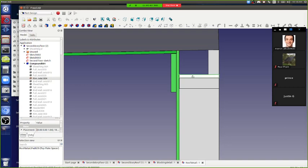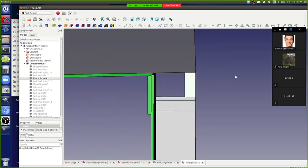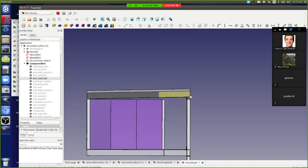So you're gonna have 4 strips of that because it comes in 8 foot. For this one, you might have some 16s. We do have at least one, but yeah, you can draw those out in 16s. So just call them two of them. These are basically going to be formed into the rectangle around, like just the plywood. One side, just one side, because it's slanted. The riser, right. It's just the riser. Okay. The 1/2-inch exists only on the back wall, which is the west wall. So here, it slopes down to the front of the house. Yeah, I get it now, because you have the 1/2-inch to make it exactly 4 because the 2x4 is a little bit shorter.